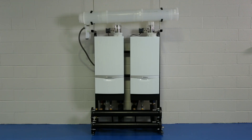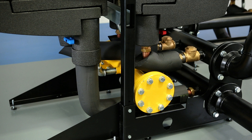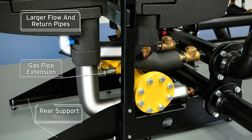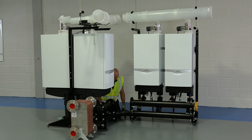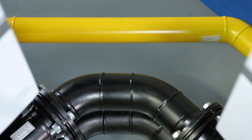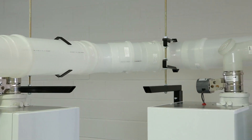There are options for back-to-back rigs, shown here being fitted as an L-shaped add-on to the rig we just built, with the aid of our round-the-corner kit, which is available for DN100 pipework only. The additional components supplied with a back-to-back rig are longer flow and return pipes, a gas pipe extension, rear support feet and the non-return flap. The first step in connecting the two assemblies is to add the round-the-corner pipes at the back of the two rigs. The ends of the flow, return and gas pipes that were temporarily bolted earlier can be securely fastened once the 90-degree flow, return and gas pipes are all in place. The flues are connected next with the addition of all necessary pipework and supports for the cascade flue system.